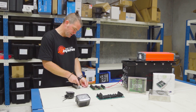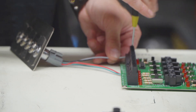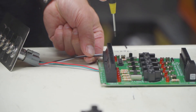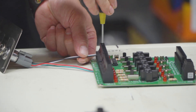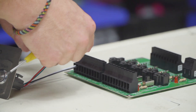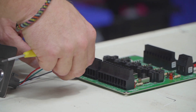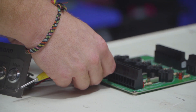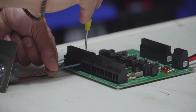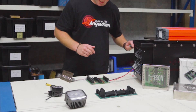We connect the white cable — which is positive — to the switch power supply on the bottom connector, then we connect ground. That's important so the backlight illumination works on the switch. The return cable on these switches is the green, which is the normally open contact, and the red makes the LED turn on. I connect that to number one, which is for circuit one — connected to load one, relay one, and also to number one on the constant power outputs.